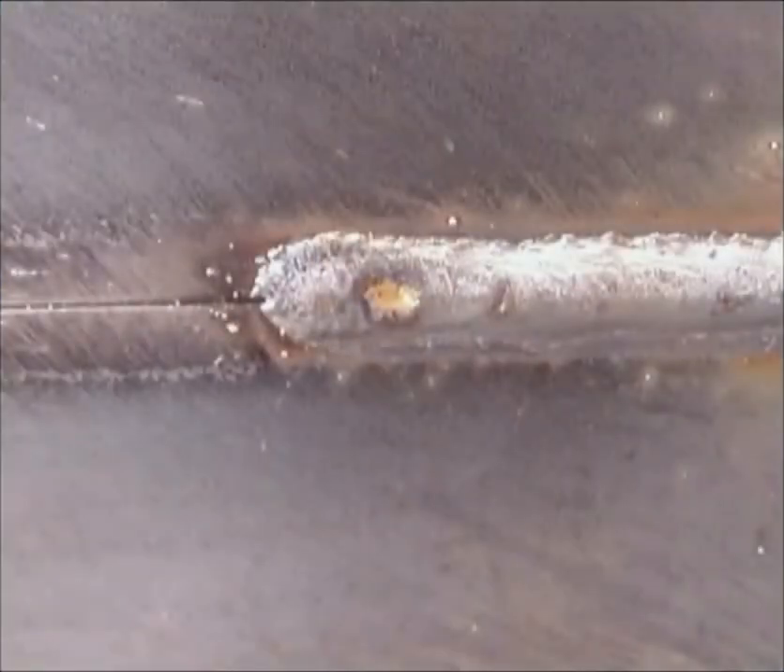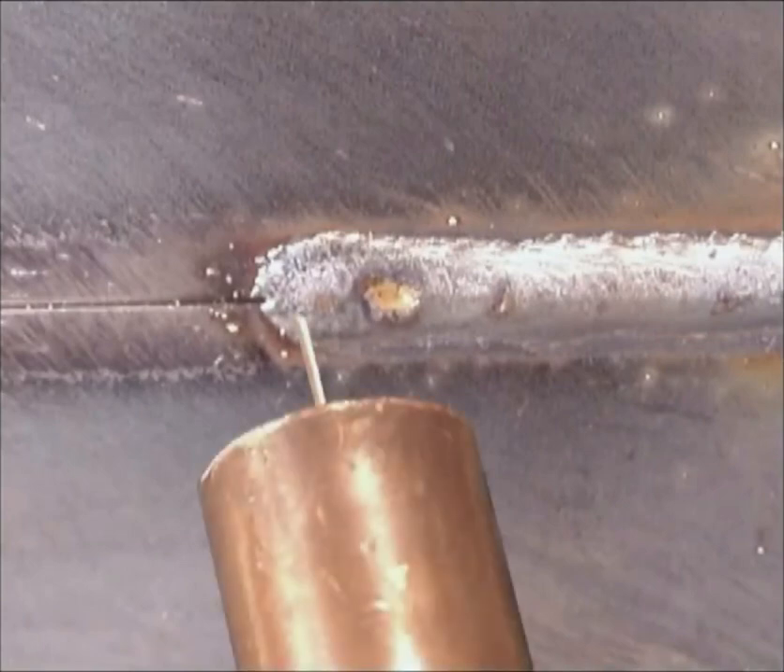So far, all the demonstrations have been in the flat position. For horizontal, we will be welding across. Because the weld buildup needs to solidify quicker so that it doesn't sag or drip, slightly angle the gun up and in the direction of travel, keeping the heat of the arc away from the molten weld buildup. Move right along with the wire at the front of the puddle and maintain a uniform travel speed and electrode stick out. If the weld bead sags, make sure you are not directing the arc back onto the puddle, then try increasing the speed of travel to keep the base metal cooler.